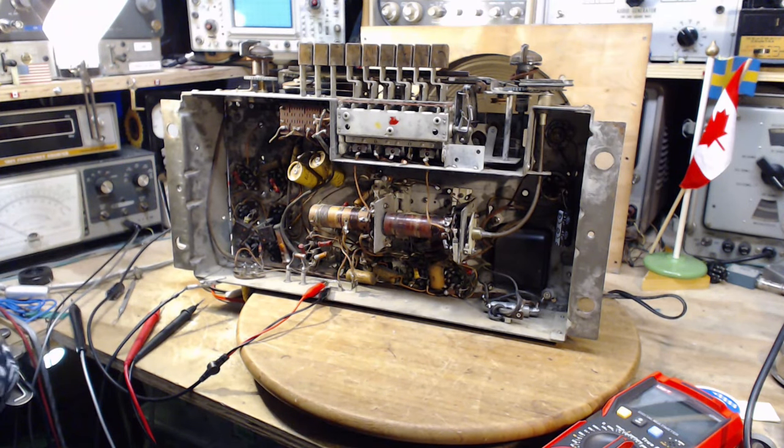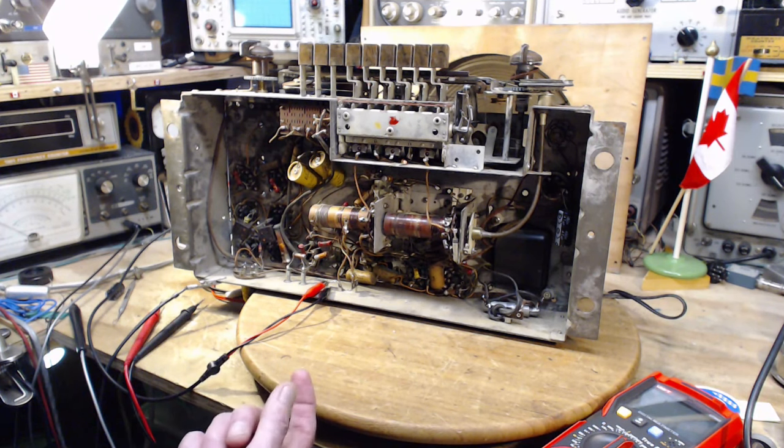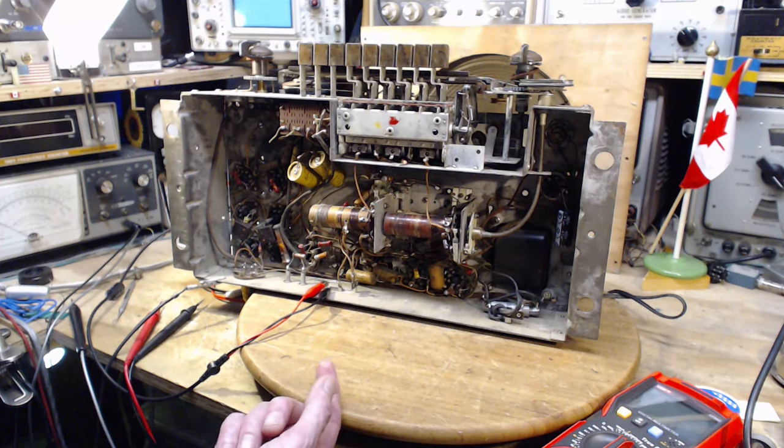Okay, I'm going to look for... And then what was the wattage? I never finished the wattage discussion. So if it's dropping, let's say, 100 volts, which is still a lot, but let's say it's doing that, 100 volts, and you had a milliamp going through it, you'd have 0.1 watts, I think. Is that right?